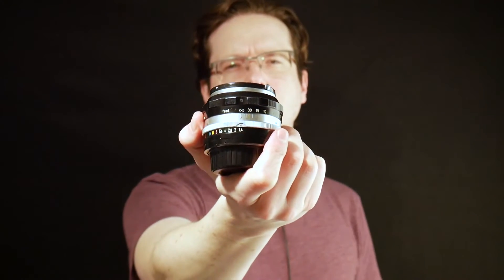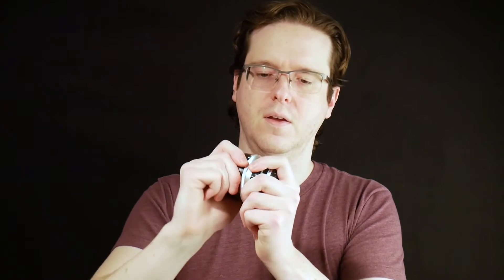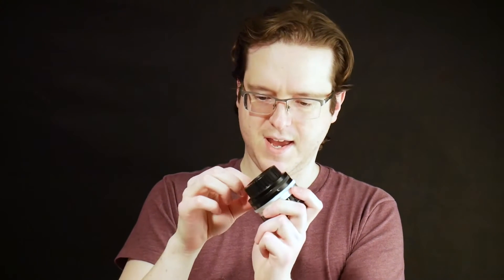As it goes on you can hear the little clicks from the aperture ring. Eventually get to the point where it's screwed all the way in. Here we have the aperture indicator, so we want to unscrew the lens back to showing f1.4. Then, because that won't leave enough lip material on the aperture ring, unscrew it another full rotation back to f1.4, and that will have enough material sticking out so the aperture tab will catch and be able to follow it.